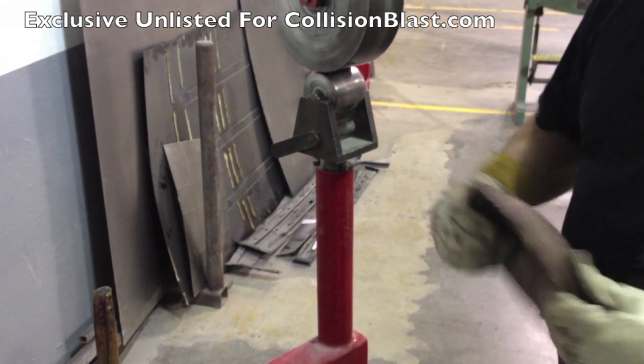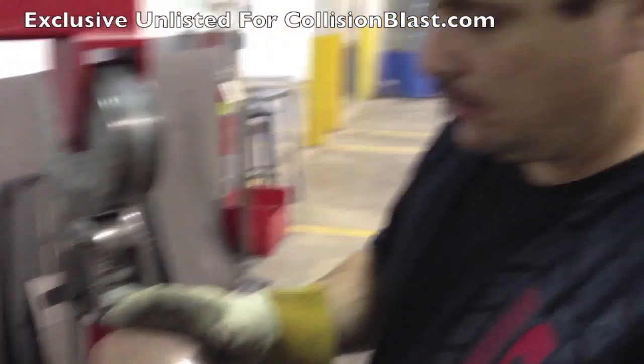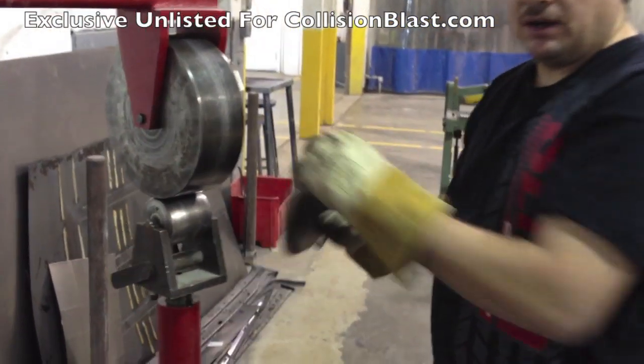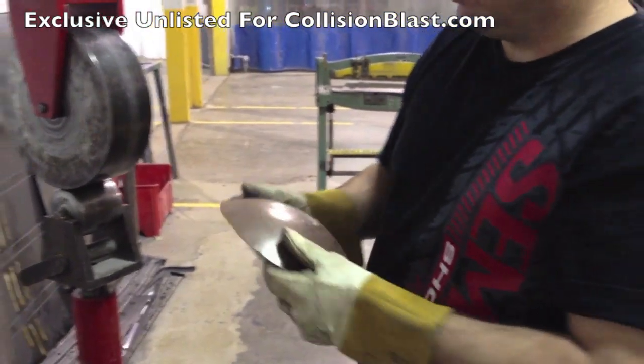You're almost ready to get it going. Now I'm just going to follow through with it. Notice whenever I go all the way through, at the very end I'm not going to lift up — I'm just going to keep that bow falling through. That'll help keep the round surface and level out all your wrinkles and dips.